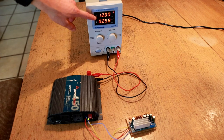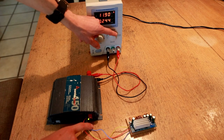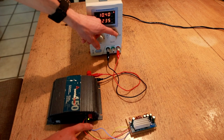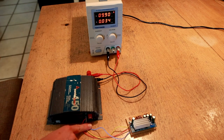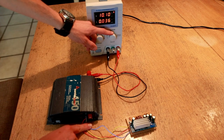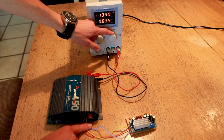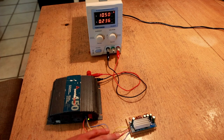I'm supplying the inverter with 12 volts and you can see the green light is on, indicating the inverter is active. I'll start decreasing the voltage gradually. When we get to 10.5 volts, this is our upper bound threshold, but since we're still above the minimum threshold it's not going to turn off. When I continue down and hit 10.0 volts, you'll see the light goes off just under 10.0 volts. Now as the battery starts recovering and voltage rises, it doesn't turn on yet — this gives us headroom to prevent oscillation. When we hit 10.5 volts, it turns right back on. That's exactly the behavior I want, and it's not the behavior it had originally.